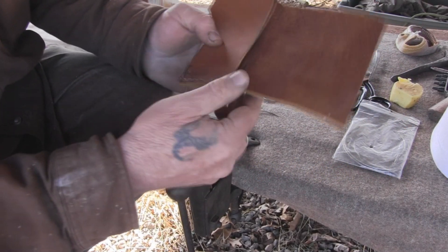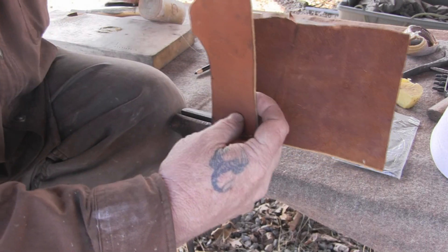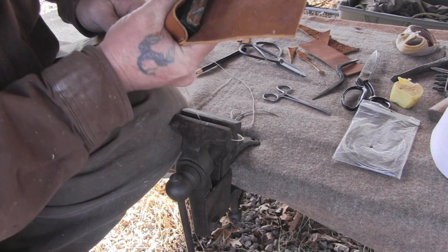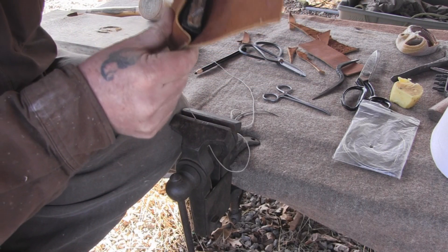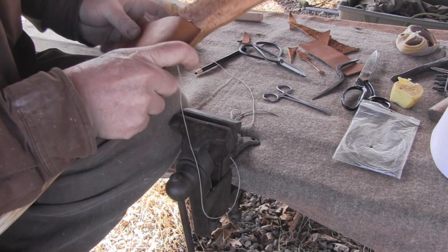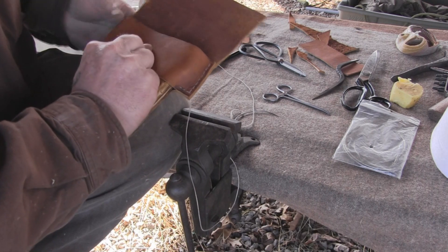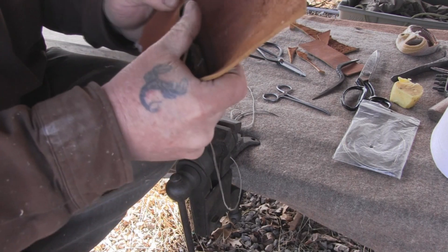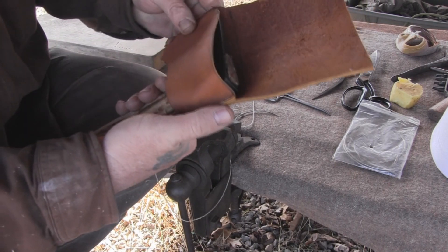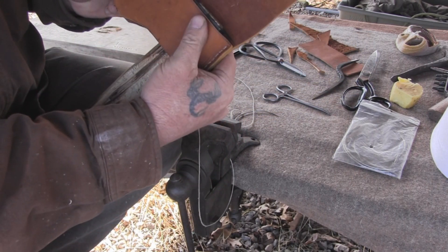There's our first run on this thing right there, and that's where the axe is going to sit in here just like this. That's exactly why we needed to make that thing just a little bit longer and a little bit wider than we actually needed, because we're going to have that folded material right there where the back of that axe is. We're going to have to form that a little bit to get this around the head, so we had to make that a little bit bigger just for that reason.